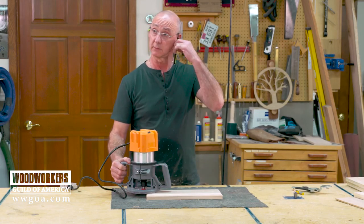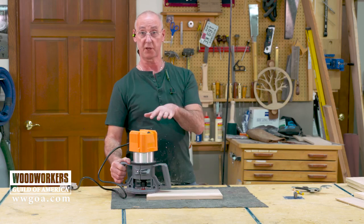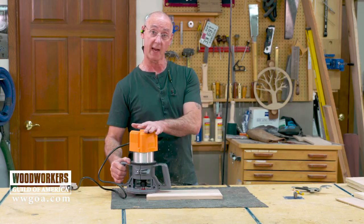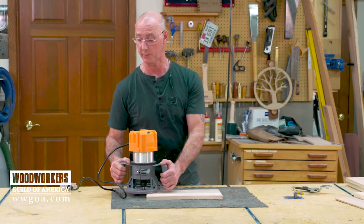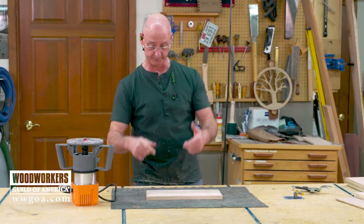Now, one thing to notice is I shut the router off, it's still there. So the router is on my work when I turn it on. It stays on my work until it comes to a complete stop. Then I do this. Let's talk about what you just saw.